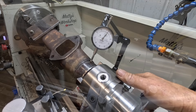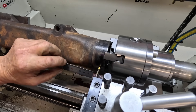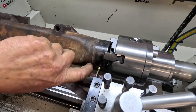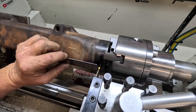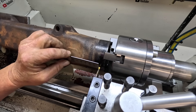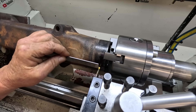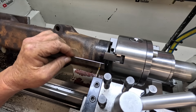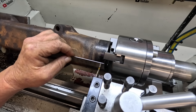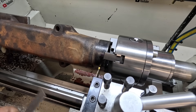According to the other manifold, from this machine face here it's 16mm. The groove is 3mm wide, which this insert is 3mm. And that should leave us 9mm to the outer flange — to the outside of this — which we have. Here goes nothing.